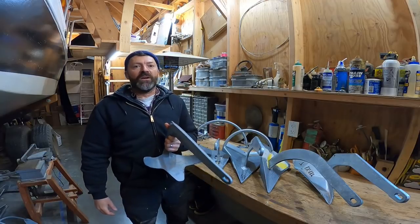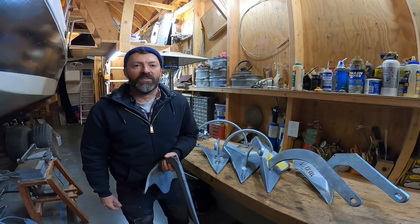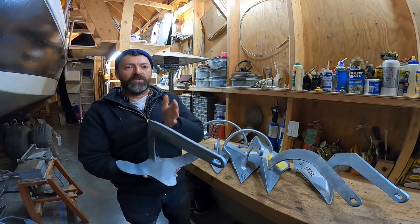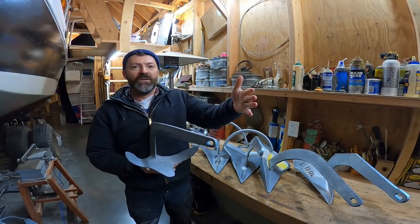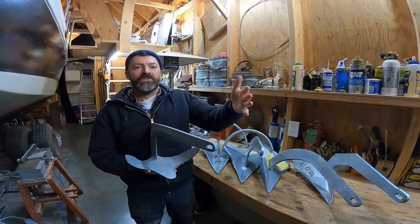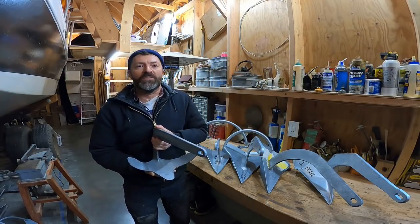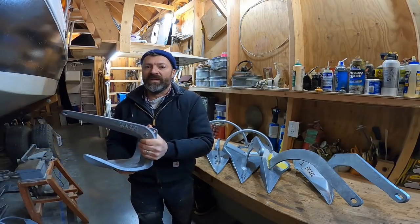For those that are not familiar with my previous veering test, let me give you the test protocol. The anchors are set straight ahead at a prescribed amount of thrust. Then I'd simply turn the engine of the boat, the test boat, just a few degrees, and that starts the boat moving in a sideways direction. And I let that continue all the way through 180 degrees.